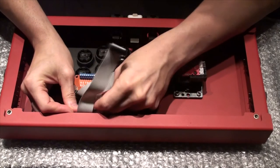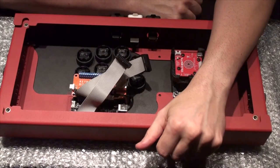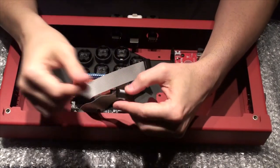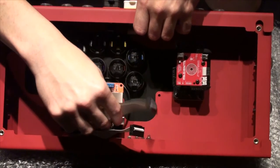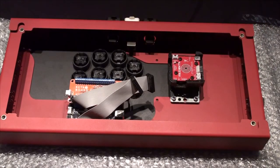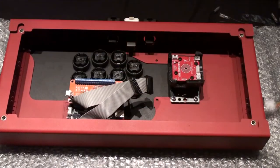It's probably better to start with the UFB since it's a little out of the way. You can line it up the other way as long as it's lined up a similar way on the jumper board. Once you've got these on, attach the UFB to JP3 and the retro board to JP1. In another episode we'll take the 20-pin harness that I've sleeved and connect that to the middle connector — and you're set to go.